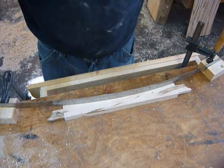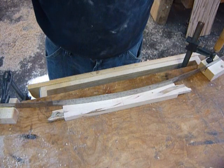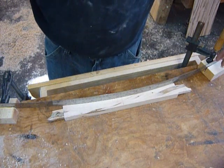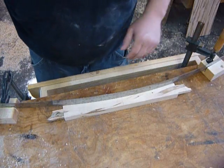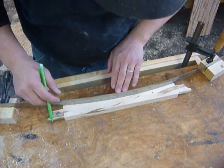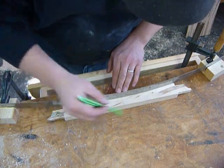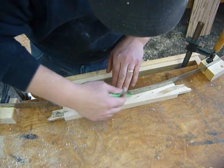So I built me up a little jig here. I just got two blocks of wood that I put a saw kerf in. I've got a flexible ruler in here. It's of course bent to the proper curve that I want, and I've just got some layout marks here that tell me where it needs to stop and start. So, I'm just going to trace out my curve here,